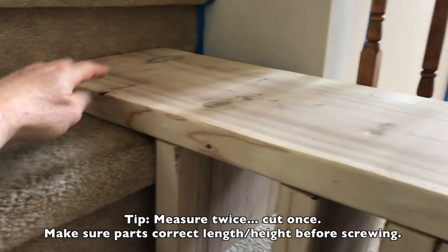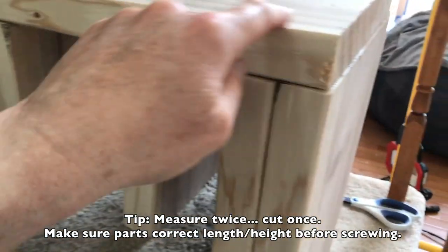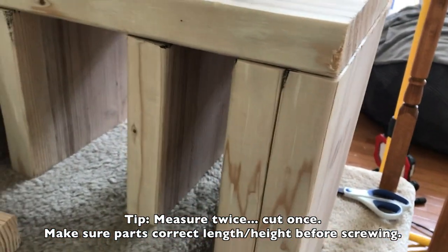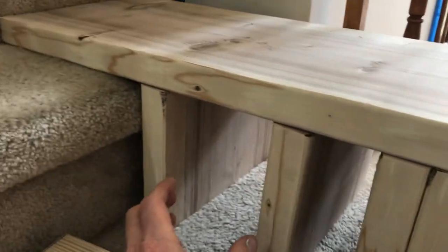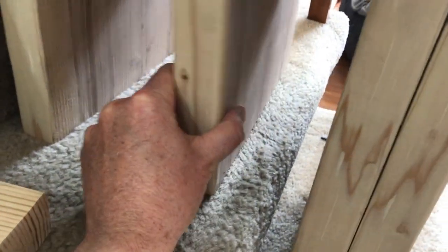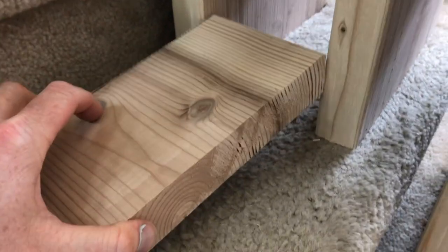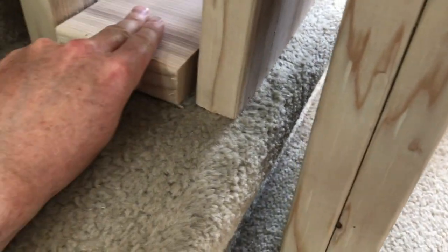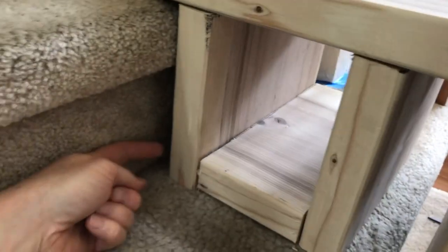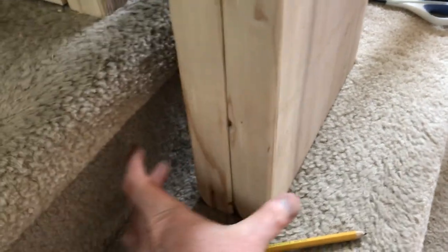Alright, I brought in all the loose parts. I made this extend two steps, and just a little bit past the second stair, because I want to shore it up with a third leg. I put two of these together. When you get these parts in, you want to kind of leave these loose — you don't want this hanging off the end of the stair. So you want to position it maybe an inch back, then measure this gap, and cut this piece so that you can make it square. Just like that. The next step is to put some screws in, screw it in from the side, and then screw these in. I'm going to put some screws through here so that these are together.